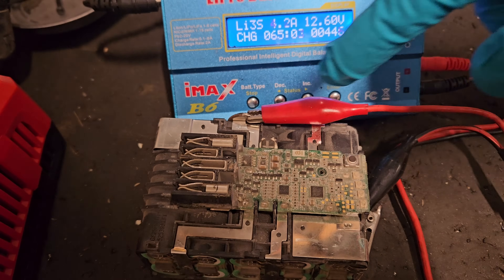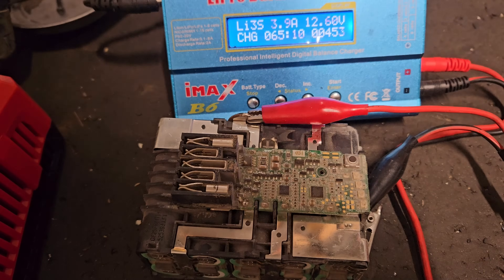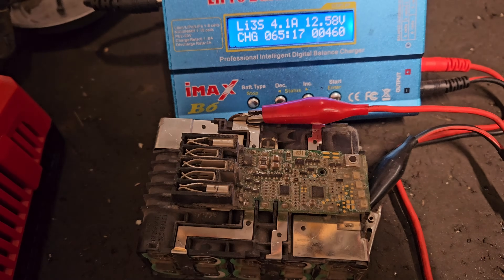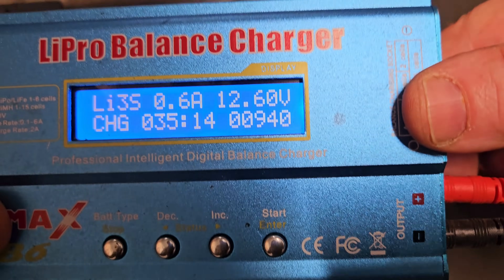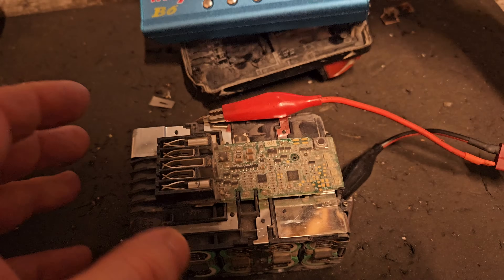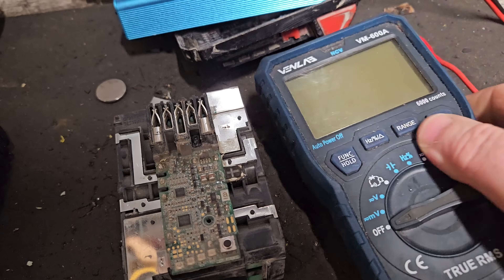I'm going to leave it for a while and come right back when we're up to where we want to be. These three banks of cells are now coming towards full charge — you can see the amperage is starting to drop and the voltage is starting to rise, so we're getting there. With these three nearly done we'll move on to this one and we should have a fully balanced pack. And here we are much later. I'm going to switch this off. You can see it's got down to less than an amp and the voltage is fairly high, so I'm going to stop it now and see what these three banks read.